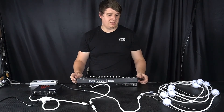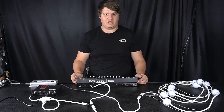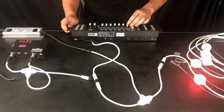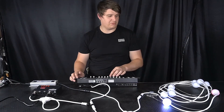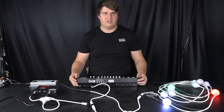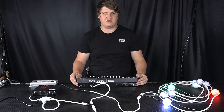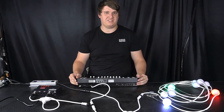As mentioned, these do take RGB — three channels per ball — which means you'll have 30 channels per string in this case. So the first ball has your R, G, B, then you get your second ball from channel four, and so on. So there you have it — that's how you basically control the fixtures and set up the DMX addressing. If you've got any more questions, contact us and we'll be happy to assist.